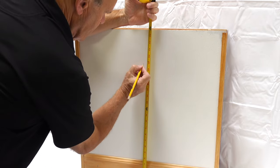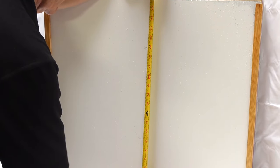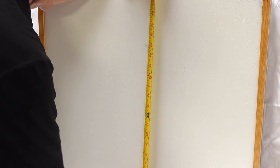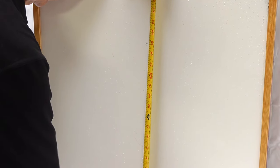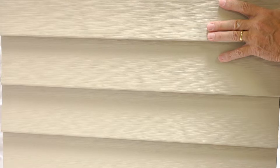On your inside wall, find a convenient place for your indoor six outlet power panel about 19 inches from the floor. The location should be between wall studs and should not be in direct alignment with known electrical lines or water or waste pipes. Once you have determined a location, measure and mark the spot with a pencil. Then look on the outside wall of your house directly opposite from your inside location. Make sure that spot does not interfere with other outside objects such as bushes, utility or cable TV boxes, and other immovable hookups. Also make sure that the location and height of the power inlet box will allow enough room for a generator cord to be plugged into the bottom of it once it is mounted on your outside wall.